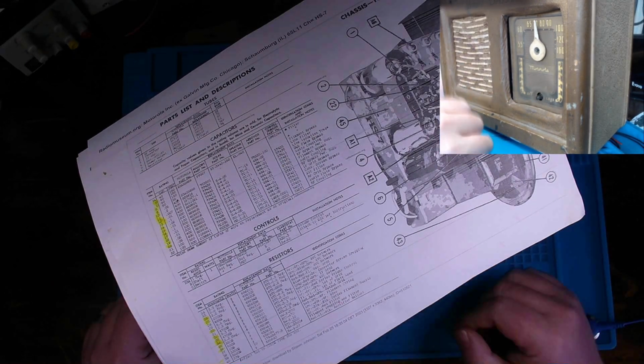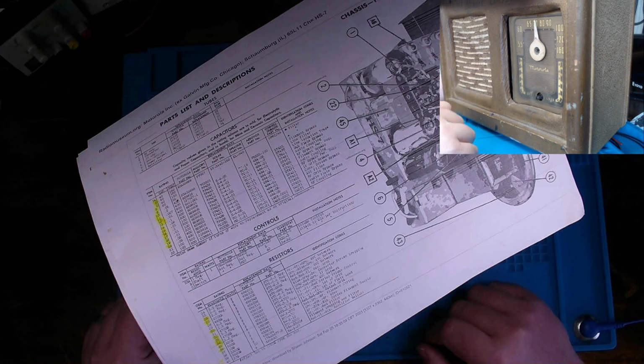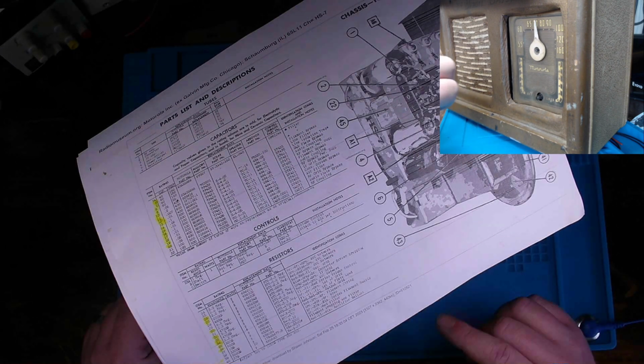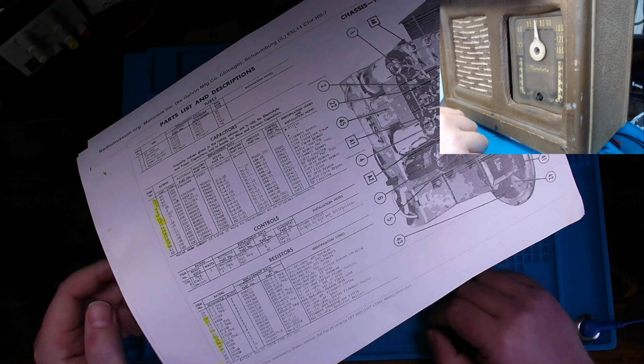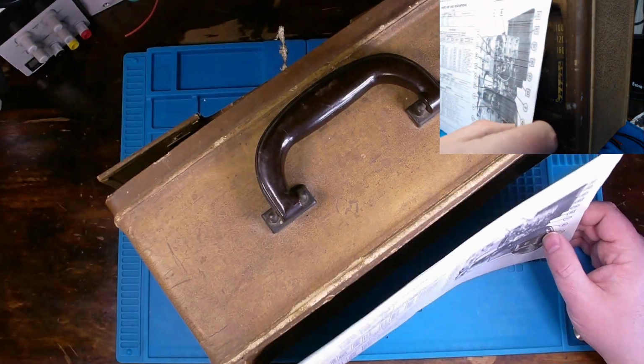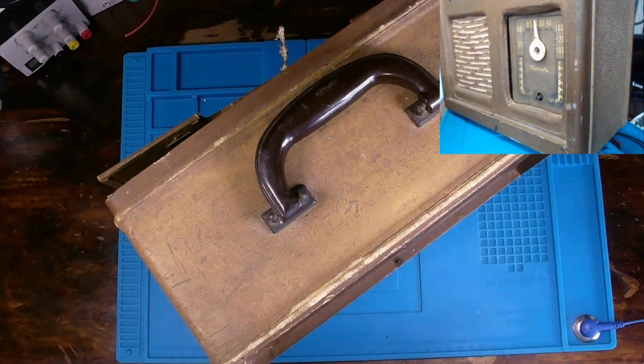I'll place a power cord on this, and get a proper cross the line cap put in to lower the current to our chassis, and some other things too. But that's the basis. I highlighted everything to the customer, and they were pretty happy with the quote. So we can move into getting this thing back functional.